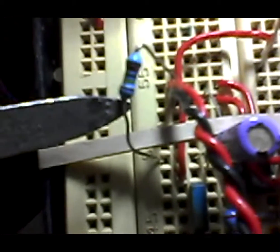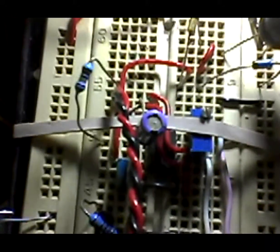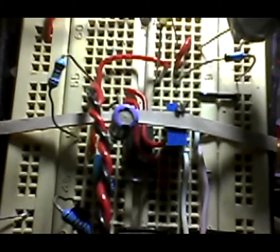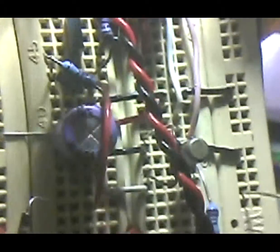Oops. On my circuit diagram, I've got it going to pin 3. That's the non-inverting input. Basically, it's supposed to go to the inverting input, which is pin 2. Because of my wiring, I moved the plastic band out of the way, because it's what holds all this lot on here. But when I was following the wires, I realised, oops, I made a mistake.